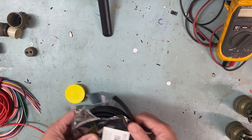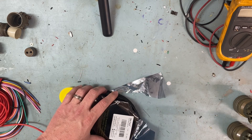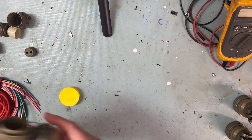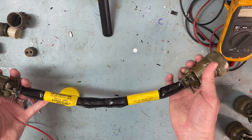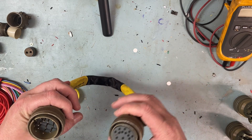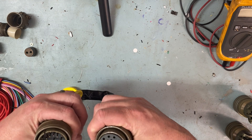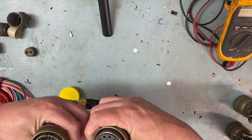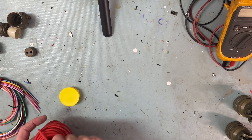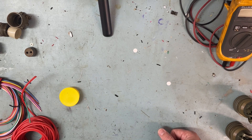To protect all of it, I bought some one-inch expandable sheath — it compresses, so it'll fit over this or inside here, and I can push it back so it's nice and taut. The whole cable doesn't have to be very long — maybe a foot between the connectors, just a tad more. This is the one that came off the ship. But as I showed you in the last video, for some reason this connector is clocked differently than the rest. I'm going to investigate that next time I'm on the ship. So we'll heat up the soldering iron, get some water in the sponge so we can get a nice clean solder, and we'll go from there.